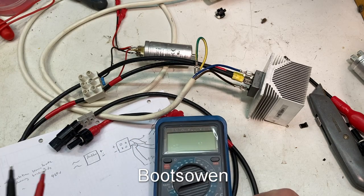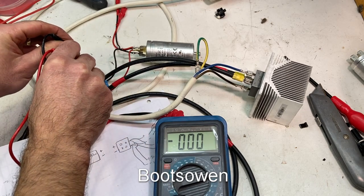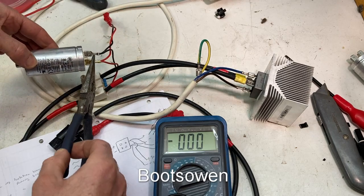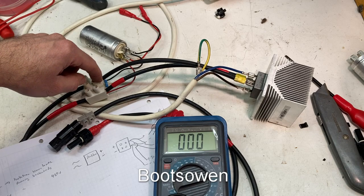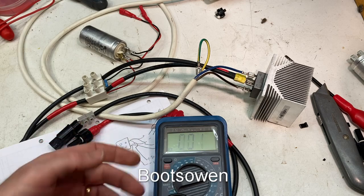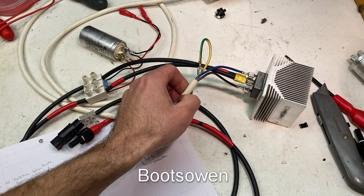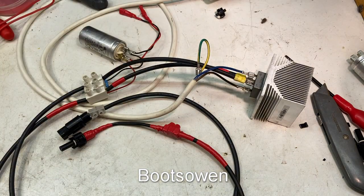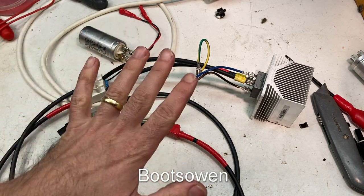So let's put it on voltage — let's put it on the highest one and just see if there's anything left in it. I don't think there is. And if you're worried about capacitors, you just have to short them out somehow — just put a piece of metal across the two sides and they'll discharge. In this case the resistor is doing the discharging, just a little bit slowly, so it shouldn't be an issue. Some people say a minute, five minutes — some machines themselves have a five-minute wind down period. I've heard five seconds for inverters — I guess it depends on the cap and its self-discharge time. Questions or comments, leave them below. Subscribe to the channel — I'd appreciate it. Give us a like if you found this video interesting, and see you next time. Thanks for watching.